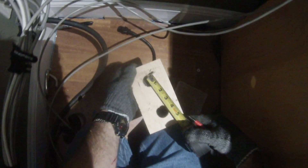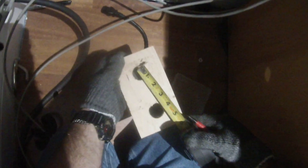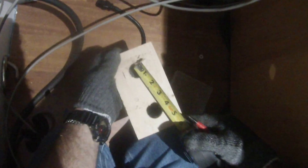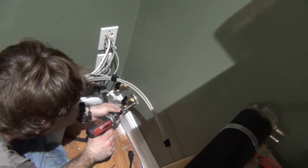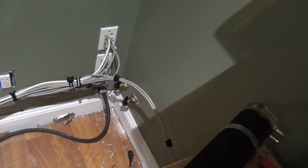The spigots are mounted to a piece of wood that sits behind the drywall, which gives them rigidity. This piece of wood has two holes in it that allow the tubing to pass through. The spigot gets jammed into the wall and a screw is driven through the sheetrock into the wooden backplate. I did have a little trouble with one spigot — the tubing was hitting the back of the wall and the hole in the wooden backplate was a little big, making it difficult to get a screw to bite.